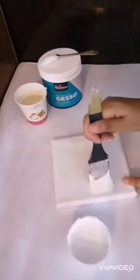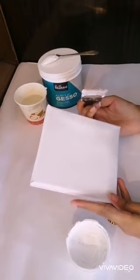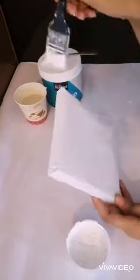After mixing it, we will apply a thick coat. We will let it dry for 30 minutes — after 30 minutes it will be touch dry — and after 2 hours, we are going to repeat this process for the second coat. We will prime it with only 2 coats. That's it.